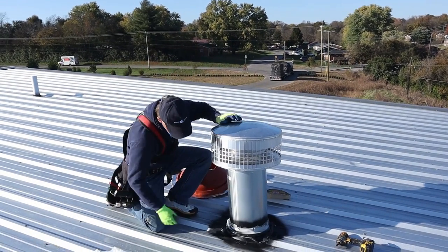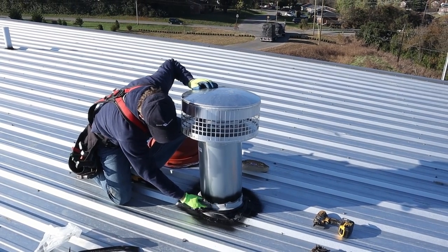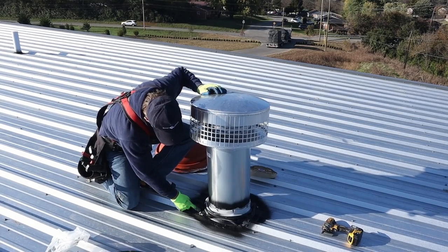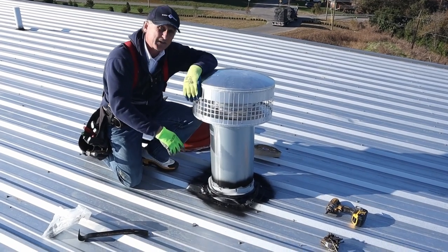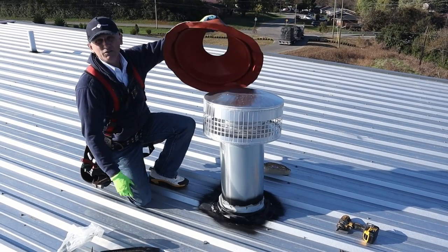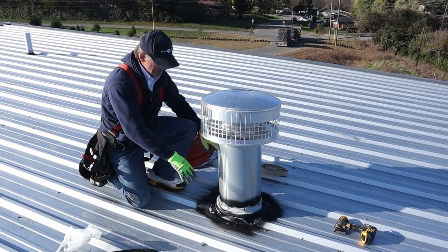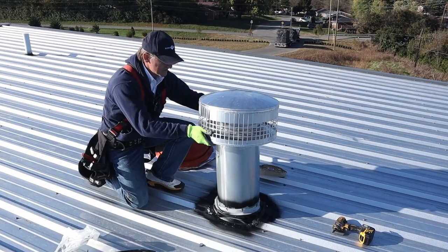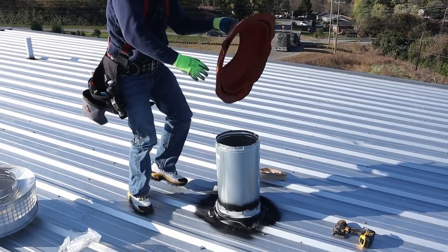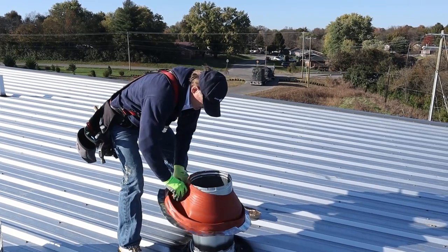When I took that collar off, you can see the roofer who put that flashing took the stress out of here, but obviously it's an opportunity for water to get in. I simply don't trust what's been done here, so I decided to go get new flashing and do it right — bury that trouble underneath instead of trying to fix it. I'll take this cap off and put the rubber boot on it.